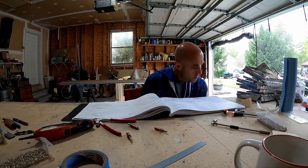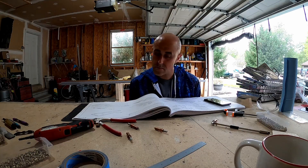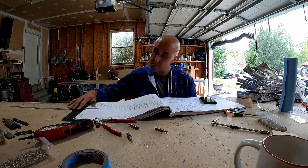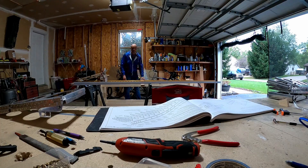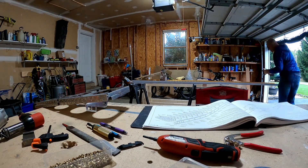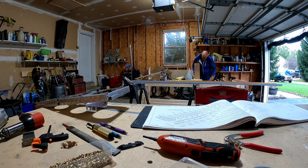You rivet that piece together — it's just like three layers of aluminum, about sixty thousandths, it's kind of thick. And on that piece specifically, you've got to file away pieces of it so that it sits inside of the flanges on the rib. Otherwise it won't nest in there very well.